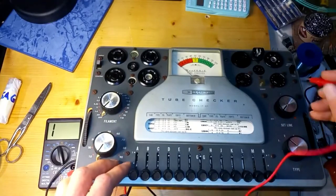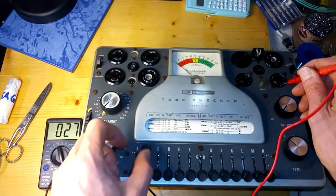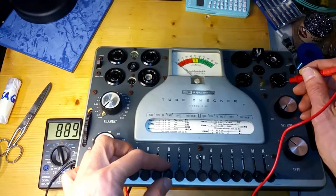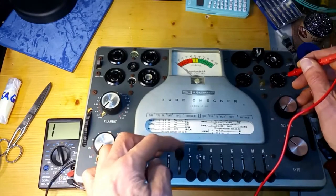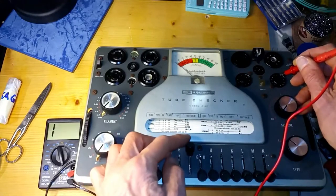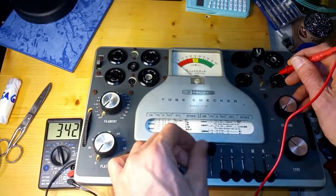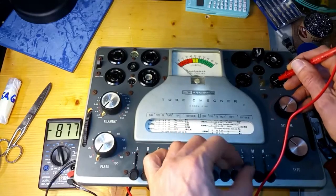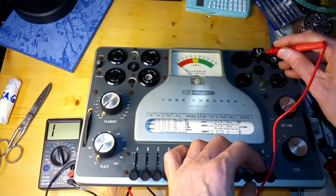It would be a good idea also to check if all the tube socket pins are connected correctly. It is very likely possible that a few tube sockets have never been used, and therefore never been checked before. To perform this test, the tube tester is detached from the power socket and all the levers start from the bottom position. A multimeter is connected to the filament 0 volts and with the other probe terminal to one pin at the time, moving the corresponding lever. The multimeter will stop beeping when the right lever is moved up.